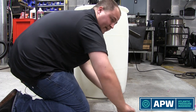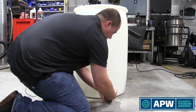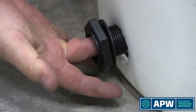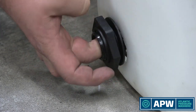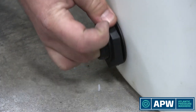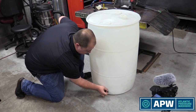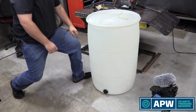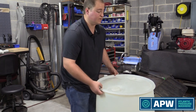Pull the band material out and put your outer gasket on. What you're going to do here is use your middle finger, put that in the hole using your thumb and your pinky, just spinning everything so everything naturally falls into place. As you do that, things will gradually get tighter and essentially move to creating a better seal. There we go — we've got a real nice sealed bulkhead fitting and it's secure. This works every time. So we have the 55-gallon drum, bulkhead is complete, everything's tight.